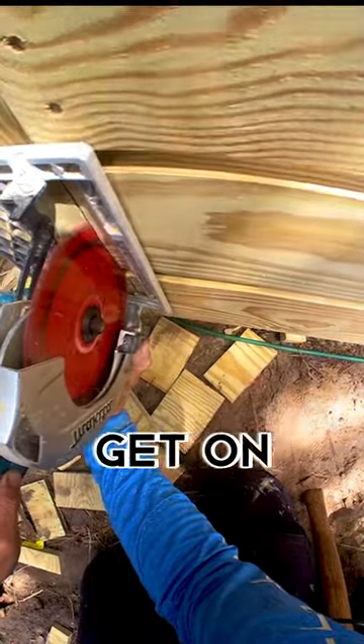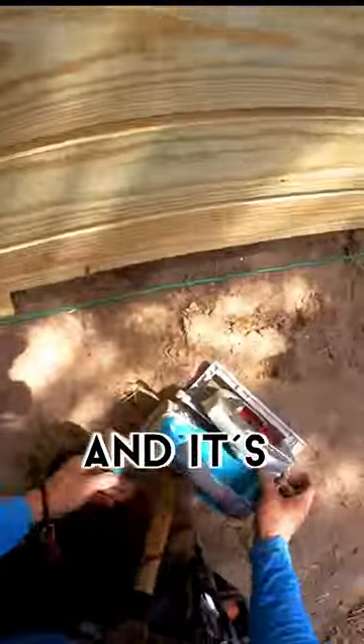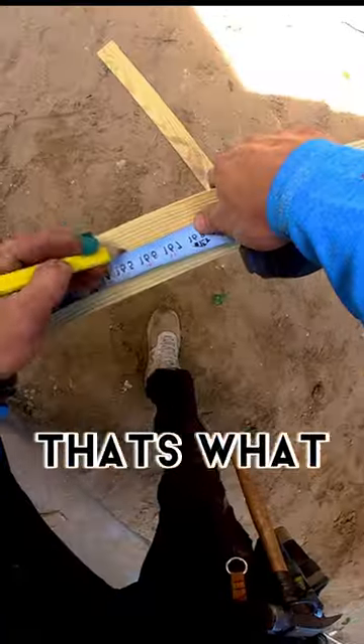Also notice that I take steps — I don't go in one full swoop. Obviously, I've got to get on and off the ladder. I'm making this cut so that we can add trim, like a little corner bead, and it's going to be in the same plane as the boards, as the builder requested.